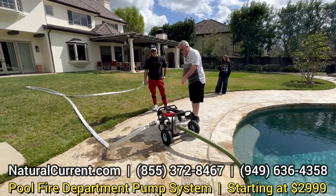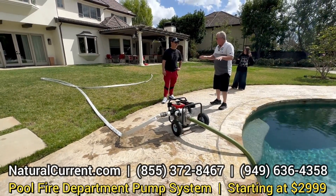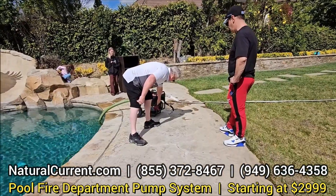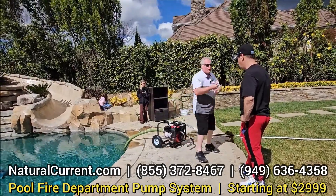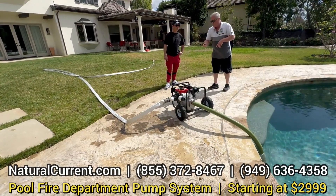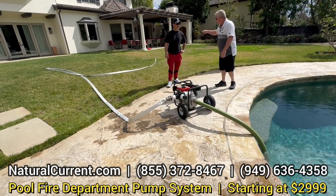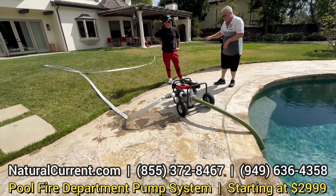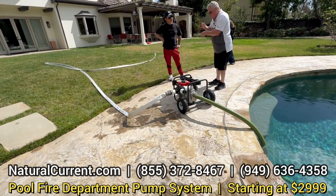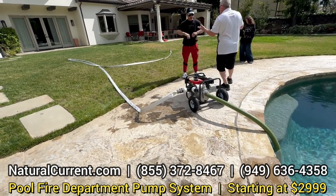Now the first thing we're going to do is turn the choke off. So we're going to take this gray lever and take it to the off position — that way it can run. If you don't do that, it'll just putter-putter and never take off in the RPMs. So that's very important. Then the next thing — when we do the choke, it's going to be running idling for a second. It's going to allow you to take a deep breath. It's idling. Then you can go ahead and turn up the RPMs — that metal rod right here — so you can really start squirting some water. So the main thing is: turn it on, turn the choke off, take a beat. That hose is going to start squirting water because I opened it up a little bit. If you see a lot of water coming out because the nozzle might be too wide, then adjust your nozzle while it's idling so the hose doesn't go bananas.